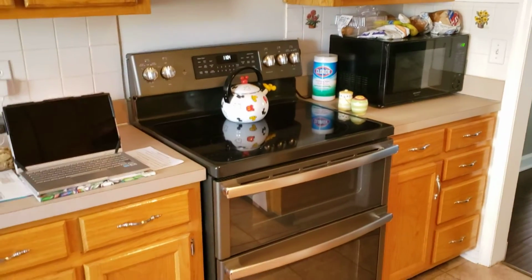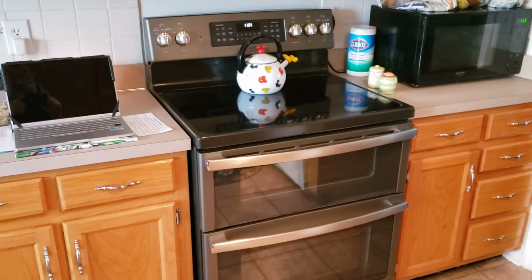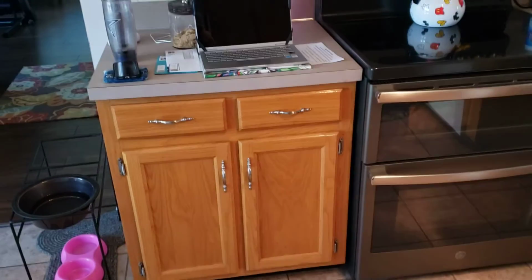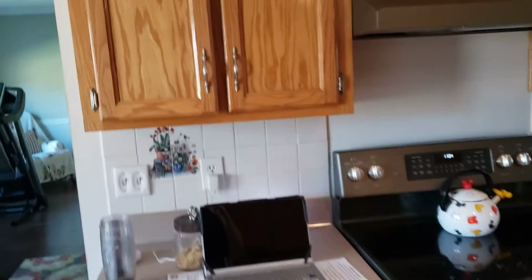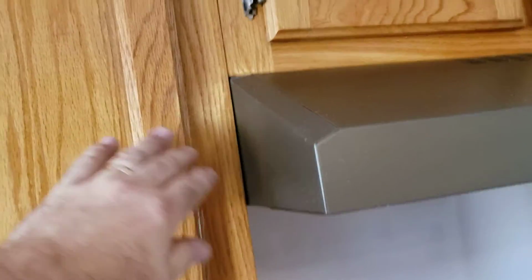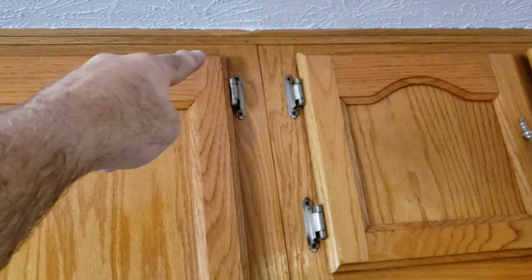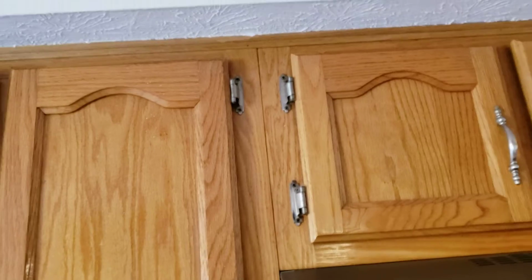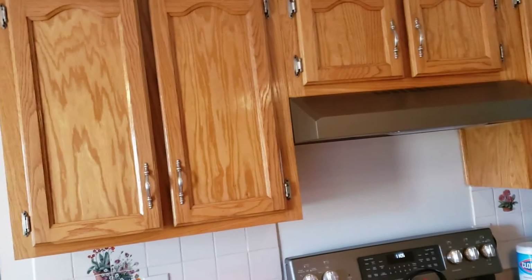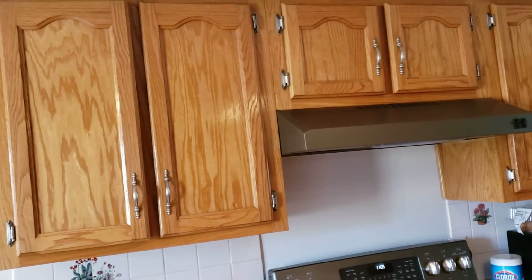Basically, this is a newer double stove, 30-inch electric. That's a base 30 to the right and a base 30 to the left. One thing to show you: these are standard overlay. Not the hinges, but the actual width of the space here is standard overlay, and that allows you to have room to put a small molding up here at the top. So when you go to design this, we would highly recommend a standard overlay cabinet, shaker door style, standard door styles, anything you want, not the cathedral.